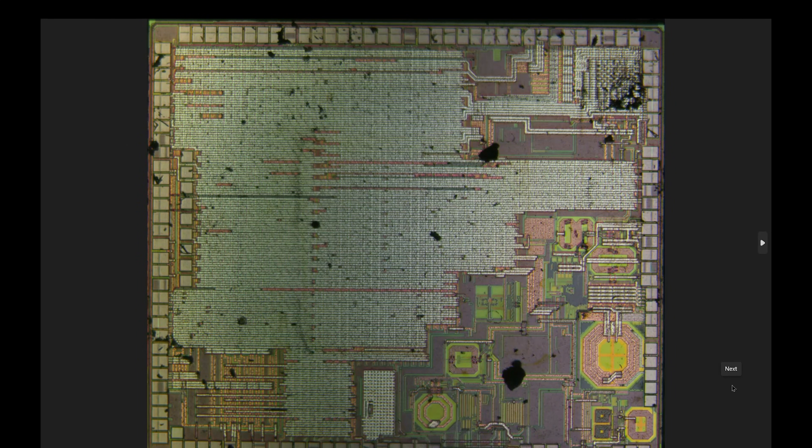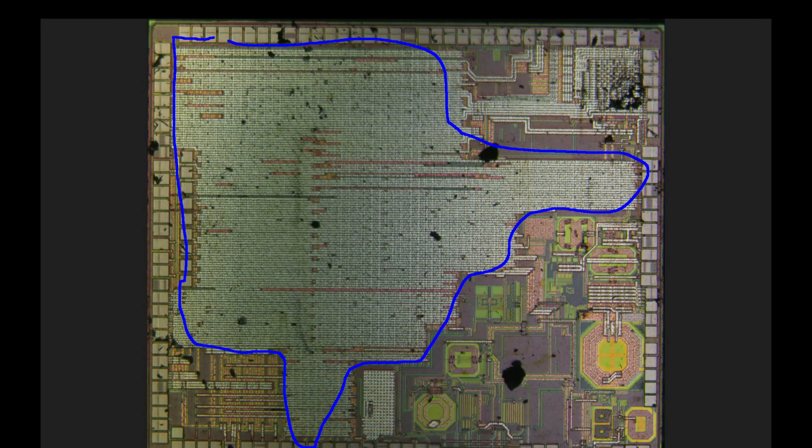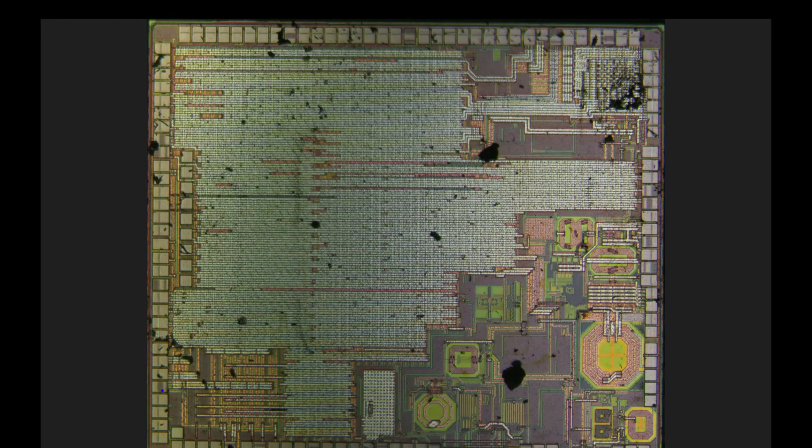Let's take a look at the major bit of silicon. This should look very familiar if you're a follower of my channel. We see a lot of these chips where there is an RF section nestled down here — a complete Wi-Fi section with phase-locked loops, mixers, and ADC and DAC converters. The silver stripes going back and forth are the power distribution network. In here is a complete microprocessor of some power, with enough RAM and ROM to act like an endpoint. Only a few pennies now for this circuitry. The less metalized areas would have things like the power-on reset and more analog functions, including any on-die regulation. Pretty modern bit of silicon.